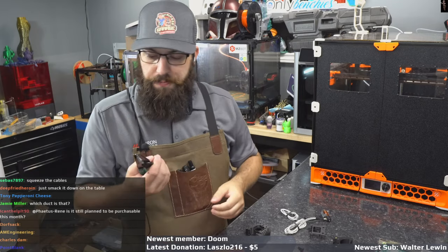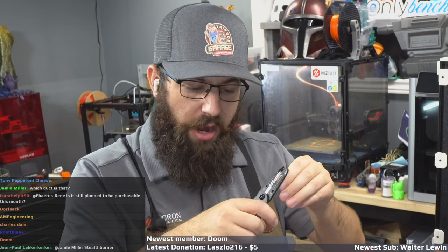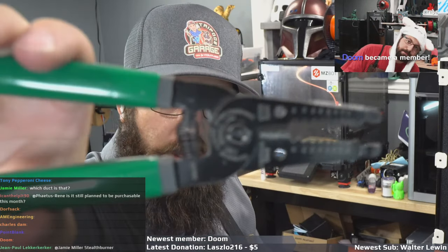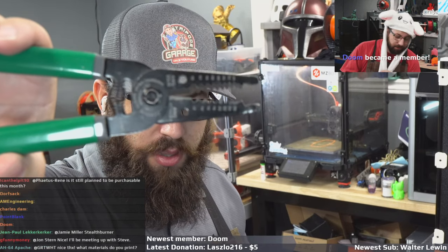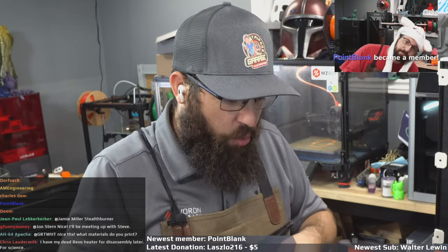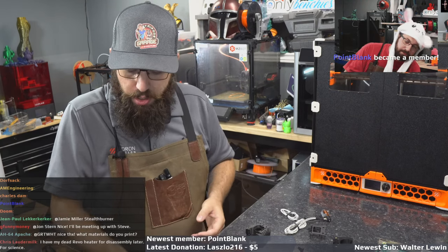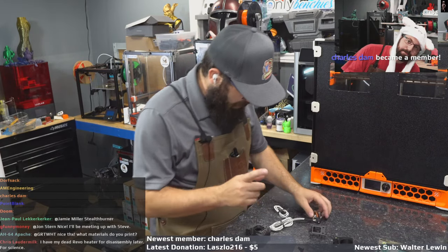So, you have your fancy wire strippers here, okay? And there's 4 wires that come out of the Revo. 2 heater, 2 thermistor. Well, I had one of the heater wires in the thing, and I went like that. However, see this spring there? Focus on the spring. So anyway, see the spring? I had accidentally pinched a thermistor wire in there. So when I did that, I also ripped the thermistor wire out of the Revo. And if you know how a Revo works, it's directly into the heater block. You can't replace that wire. It's dead. So that was my fault.